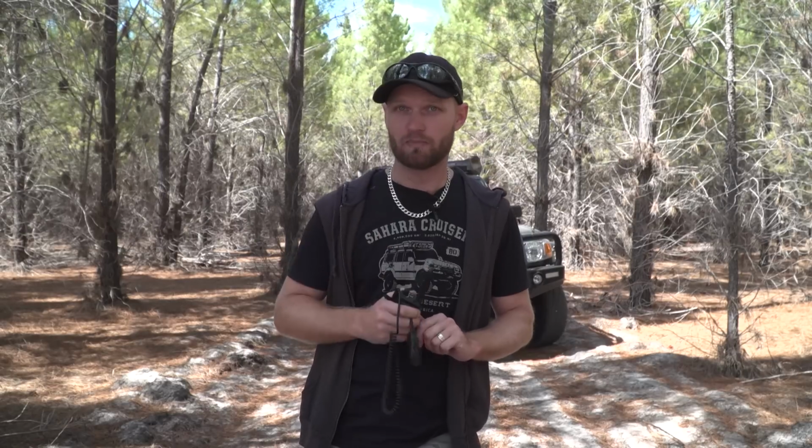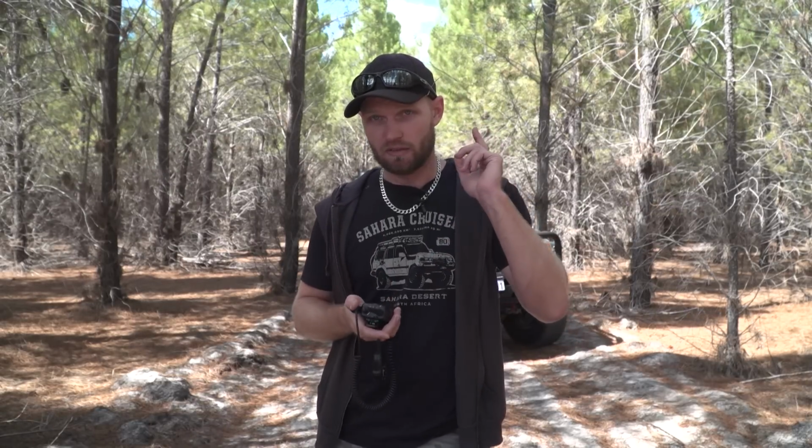Basically, in Australia on the UHF channels, you've got channels 1 to 8. They are duplex channels. Do not use those in simplex, please, because you clog it up. Now, in those channels, you pick one of those and you need a repeater tower. What it does is you will send to a repeater tower, and the repeater tower repeats your signal. The reason to have this is so they increase your range on your signal. It can go over 100 kilometers, like more range, so someone else can pick you up.